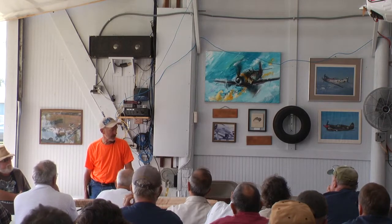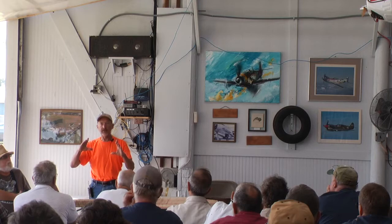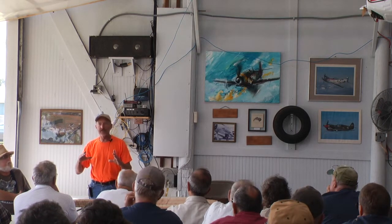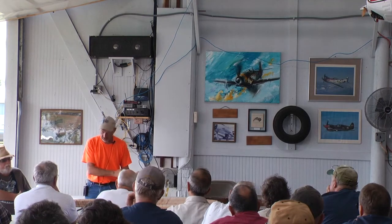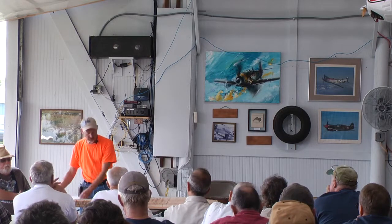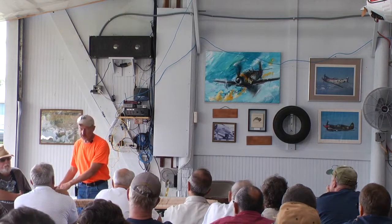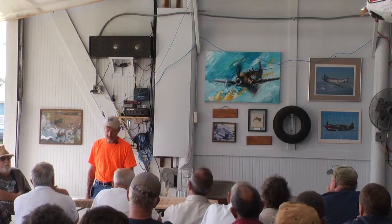And the second step, he used a 7 or 9 inch diameter disc sander with like an 80 grit paper. And that really takes a lot of material off on one stroke. And it works very well. It takes a lot of material off. It creates a tremendous amount of dust. It's one of the disadvantages of it.